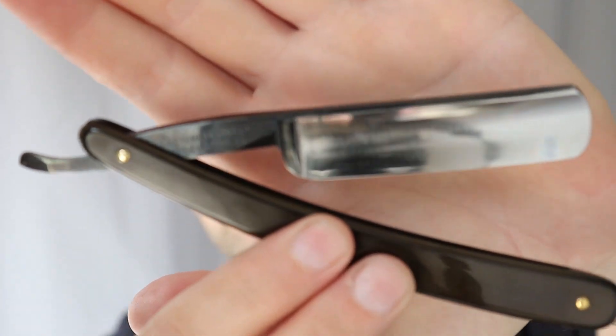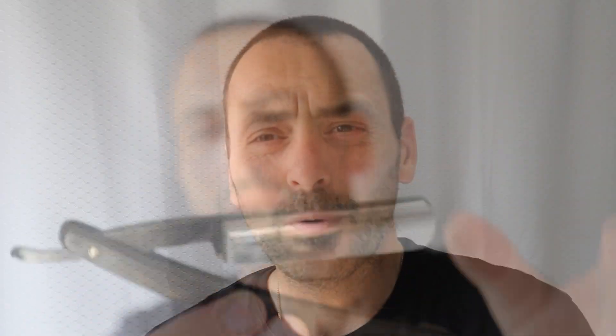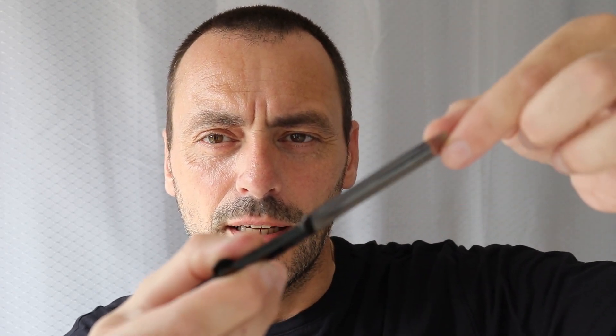But the reason I'm bothered with this one really is the grind is really good. And what I mean by a good grind is — you do this really with full hollows — you take a full hollow and turn the light on indoors. Get a beam of light going across the length and then roll the blade and you see what happens to the light as it reaches the bevel. If the light stays in that line then basically you've got a good grind. Obviously you've got the belly, the light's going to go a bit funny on the belly, but the belly on this is really — you wouldn't even know there's a belly there.